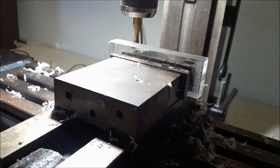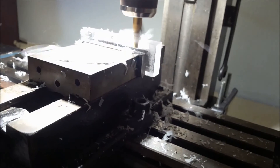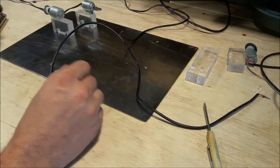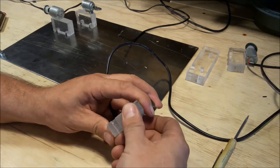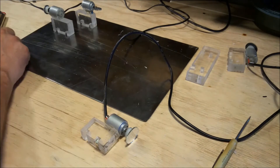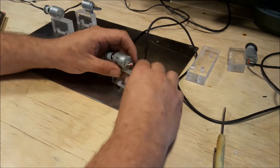We're going to go ahead and cut the acrylic that holds the laser — I had to cut the straps to get it in the milling machine, then come back and mount it with new wire ties. What we're going to demonstrate here is how the magnets were inserted. Most of them were interference fit — I just pushed them in and they stayed. I did have to glue one set of magnets, and I tested it on the bench and it holds really solid.